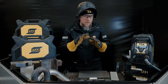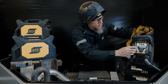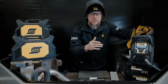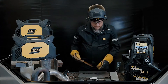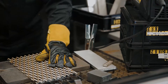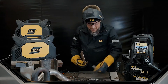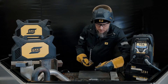So that's the different types of materials. The processes you can do are cutting and gouging. When I gouge, I switch this over to expanded metal mode — that allows me, if I stretch the arc longer and lose the connection to the material, to just bring it close again and it restarts the gouge. Let me show you expanded metal first: I'm going to pull the trigger one time and go across all those gaps. Pulled the trigger one time — it's going to start and restart that arc each time it encounters the gaps.